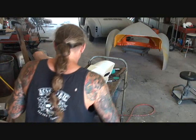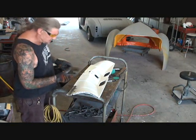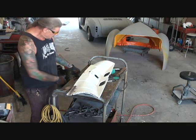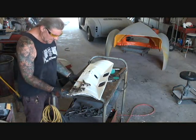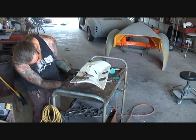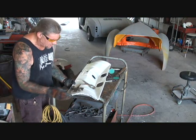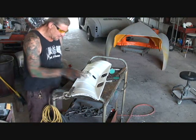On this piece right here, I went ahead and took my copper strapping and got me two pairs of vice grips right there. And I went ahead and put it behind the piece that I'm welding, right up in the corner. So I fit it right up in there, and then I clamped that on there.